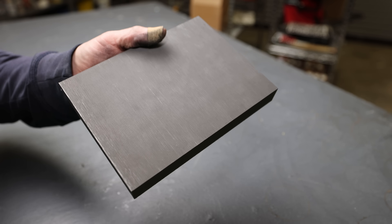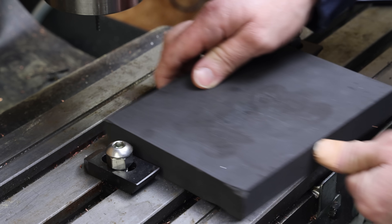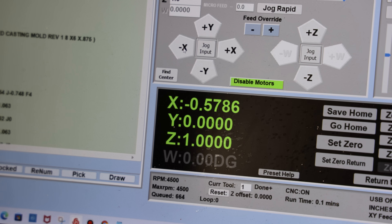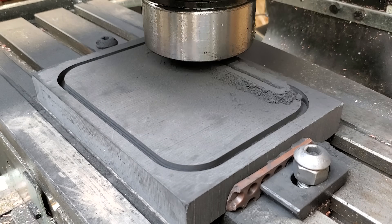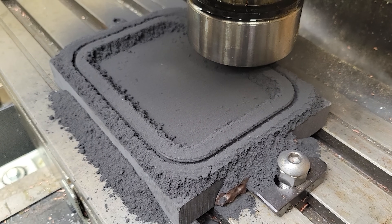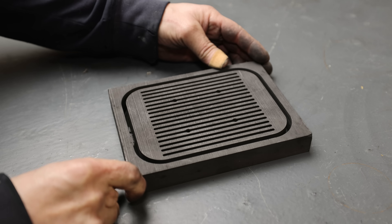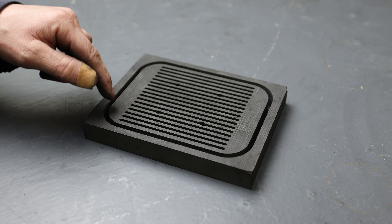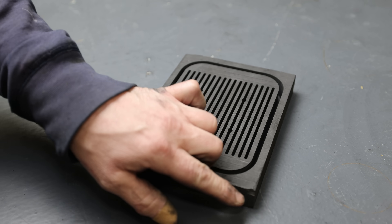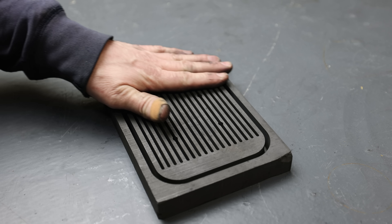This right here is a solid piece of AR06 12-micron graphite. It looks like it's all done machining and there's conductive carbon dust everywhere. Let's clean the part off and see how it looks. Here's the finished mold — came out pretty good. You're looking at 10 hours of straight machining right here, and it came out so pretty that I'm really regretting using the one piece of graphite that was all chipped up. Other than that, it came out absolutely perfect.